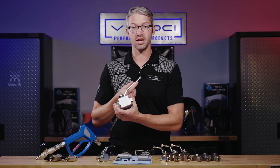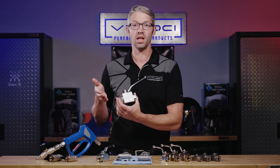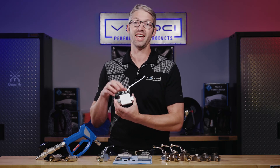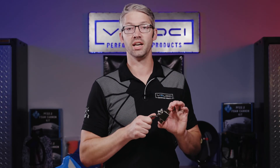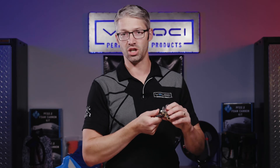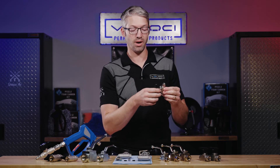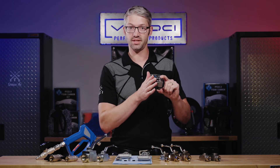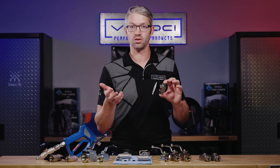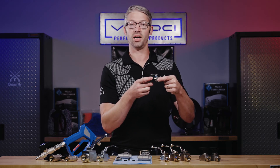The German ball valves are zinc plated, the same as the Chinese ones. However, because of the materials used and their manufacturing quality, the German valves will last exponentially longer, and they're rated for 215 degrees for hot water. The zinc-plated ball valve from China is a more economical option — typically a little harder to turn, the seals aren't quite as good, but they cost less and are easily replaceable. Finally, the stainless version from China is very corrosion resistant, but only rated for 176 degrees — considered cold water — though most cleaning methods only require 150 to 170 degrees. It also has a wall-mount nut for panel-format fixed installation.